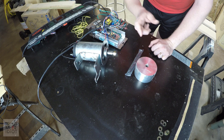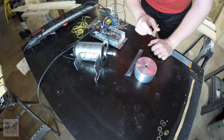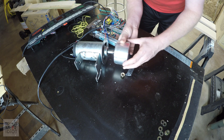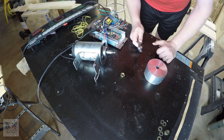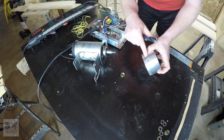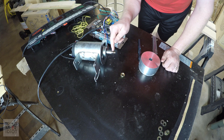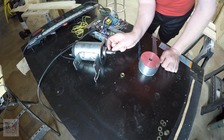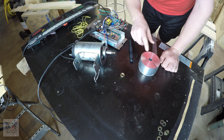Now for the last of the wheels. Idiot that I am, I ordered the wheels before I actually got the motor so I didn't know what the shaft size was — I ordered what I thought would hopefully work, and of course it won't. The shaft is just too big to fit in, so we need to modify this wheel. I could probably just order another one, but let's use what we've got. I've got a 17mm drill bit which will fit the 17mm shaft. I do want to reuse the set screw if I can, so I'm going to drill from this side and leave the shoulder so I can secure the nut. I'm not going to drill all the way through — just enough to leave some of the shaft available. So we'll tape this off, get this into the drill press, and start praying this works.